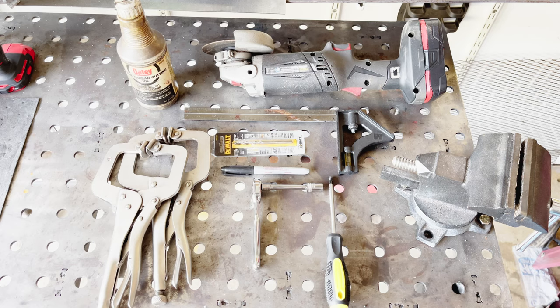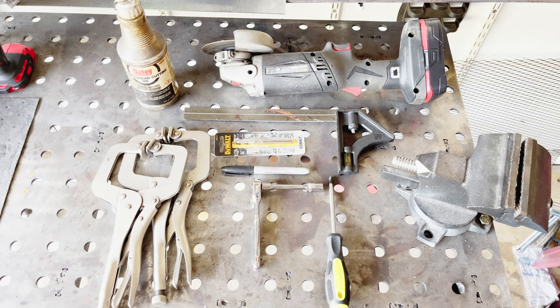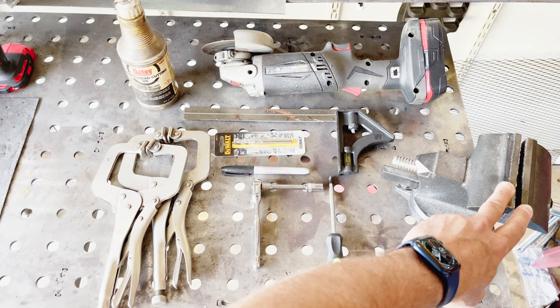For the drop fin project you're going to need some tools — we're doing some metal working here so you'll need some heavy-duty stuff. First, decide whether you need to cut notches in your drop fins. You can use a bandsaw, which worked really well, or an angle grinder — you can get those very cheap at most tool supply stores. With a cutoff wheel it will cut those notches just fine. You'll also want a vise so you can clamp the fin into a vertical position and cut the notches securely.